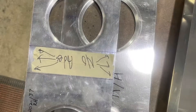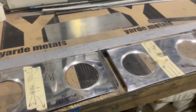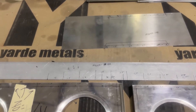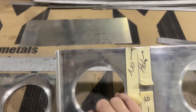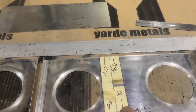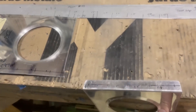We have the stringers in place and now we're working on the intermediate webs. A couple things I learned last night that were really important: sheet metal and fine-tip permanent marker with acetone are really good for sketching and figuring stuff out. As I laid out my patterns — these are the small webs — 1.5 inches is about the average distance between holes. On the ends there are a couple at 1.125 inches to make sure the spacing hits the sections. I marked with tape to make it very clear where there are no holes to be drilled. Got those all marked on the inside; I'll drill those this morning and then lay them up on the edges to drill the end holes.